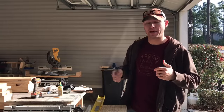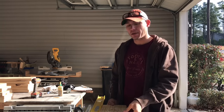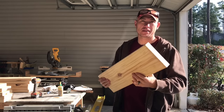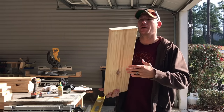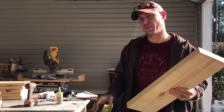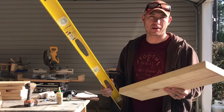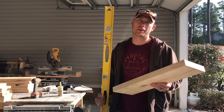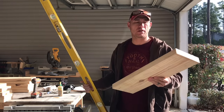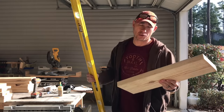Now I've got to build the tabletops — the frames are glued and painted. The way I build my tabletops, these are pine two-by-eights — you can use two-by-sixes or whatever you want. I've already cut them to length at 29 inches, and I know I need three of them to make up the width I want. I joint them with the table saw because I don't have a jointer — I'll put a link to a video up in the cards on jointing with a table saw.